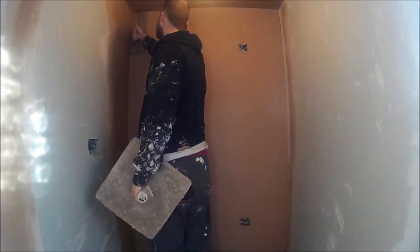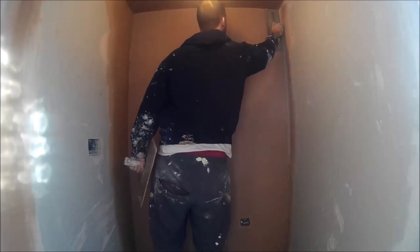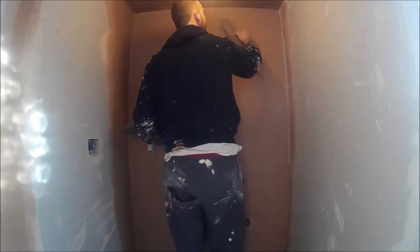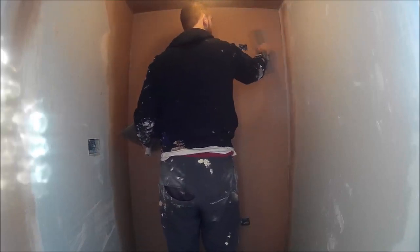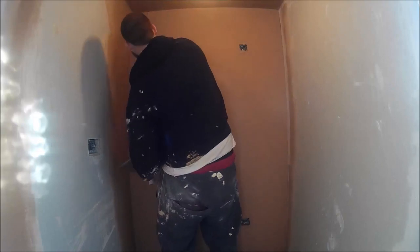Just second coating the same way I first coated — I go around wherever I first coated and then second coat that area. If I start at top left, my second coat goes on the same routine, and that'll help you remember where you're at. Get into a bit of a routine; if you keep starting in the middle of walls, parts will be drying out. Always start in the exact same place and create a circuit — a loop. That method keeps your memory on what you're doing.